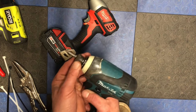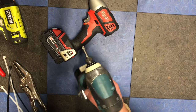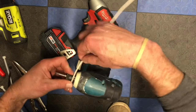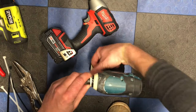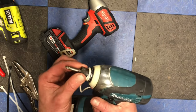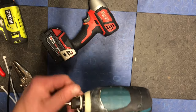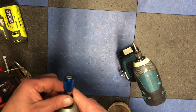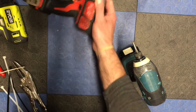The trick is you want to hold the chuck out the entire time. So you pull it back, grab a wire, and as you hold it back you wrap the wire around until it stays out. Once the wire is holding it, the bit will just come out. That works with any of these drills — same idea, you just got to get into that space and hold it out as much as possible.